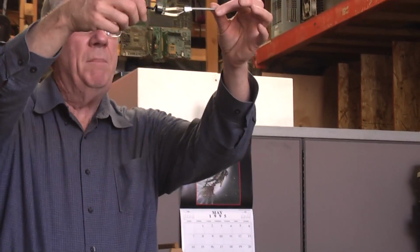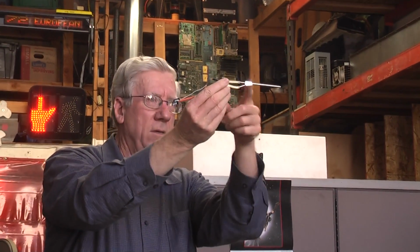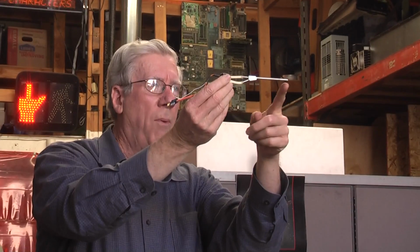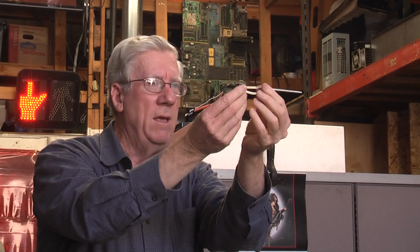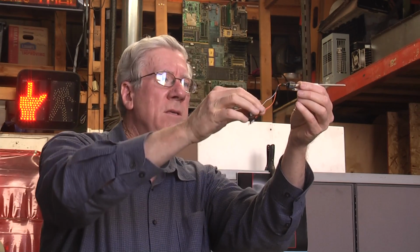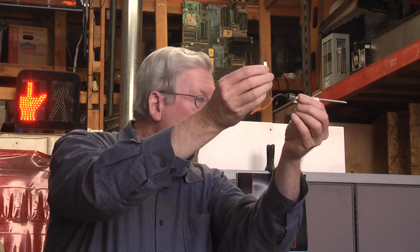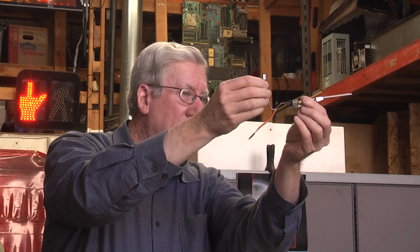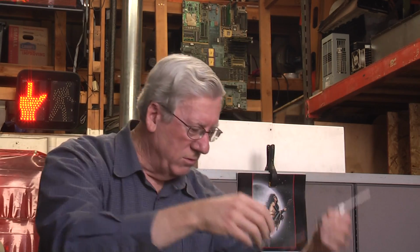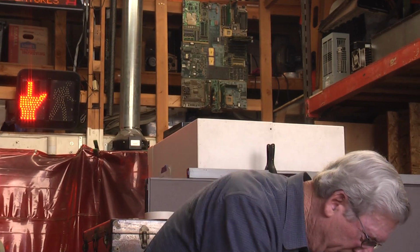This is a pitot tube. Maybe some of you who are into real airplanes recognize the configuration there. Two ports, one on the side of the tube, one on the end, and it goes to a pressure differential measuring device. I have two wires here because I needed to get the 4.8 volts from the model airplane, and then this connector goes to the sending unit that's XBee.